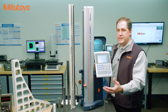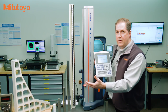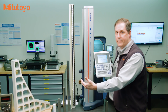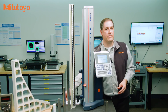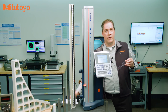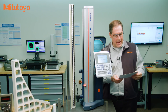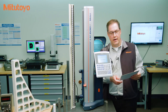For example, this Mitutoyo checkmaster — I could calibrate this using a comparison technique with these gauge blocks and transfer the traceable length from the gauge blocks to the checkmaster. Now let's get a little more official, as there are national and international standards that define the term calibration. Let me get my glasses and I'll read you the most widely accepted definition, from a document called ISO IEC Guide 99, otherwise known as the VIM, or the International Vocabulary of Metrology.